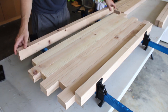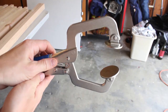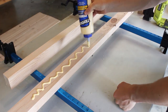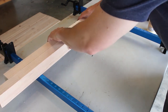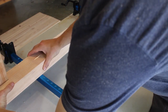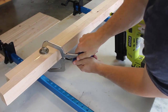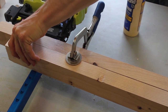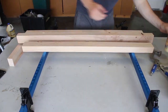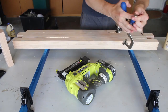Having done this before, I learned a good method for keeping glue-ups flat. Using a $20 Kreg clamp, I'd apply glue to my piece and spread it evenly, squeeze the two pieces together, and make sure the two strips were lined up properly using a scrap leg piece. Clamp them in place so that the top and bottom surfaces were flush on each side, shoot in a 2-inch finish nail, then unclamp and repeat the same process on the other side. This helped ensure a near totally flat glue-up without the fear of things slipping later on when clamping everything up. Then I repeated the process one row at a time for the rest of the top.